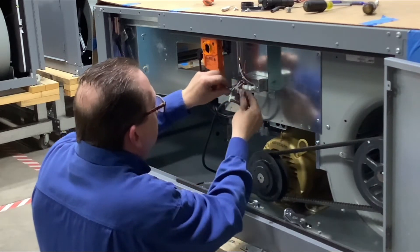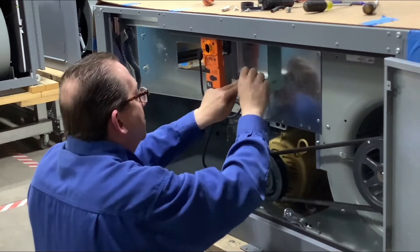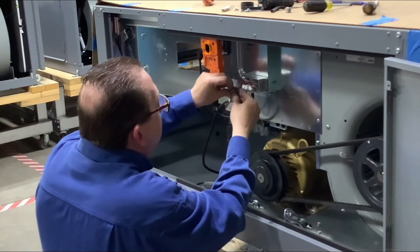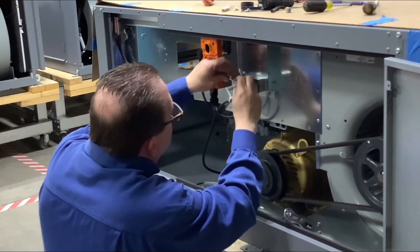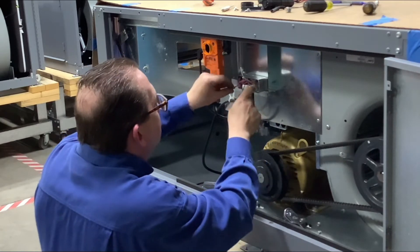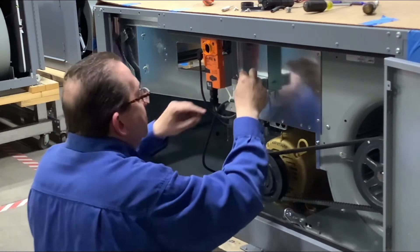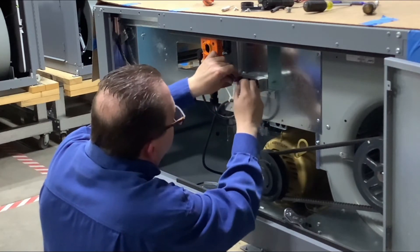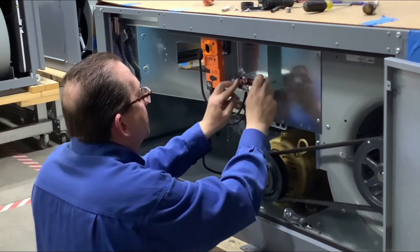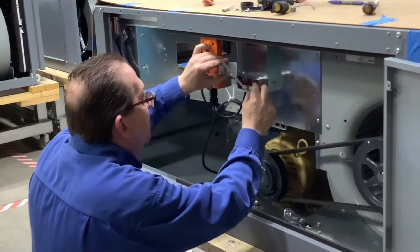In the J-box, attach the wires from the original motor cable to the labeled snapping wire clips. Insert the brown wire into the clip marked number 1 and secure. Insert the black wire into the clip marked number 3 and secure. Insert the white wire into the clip marked N1 and secure. There is a single red wire with a gray wiring clip — it is not used. Push the wires and wire clips into the J-box and install the cover.